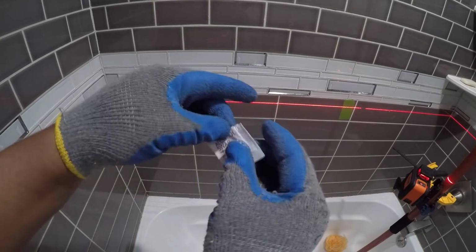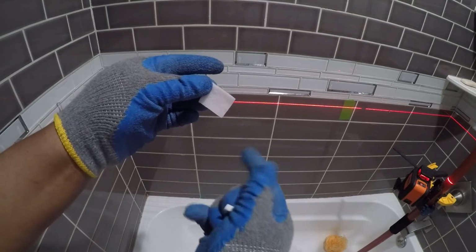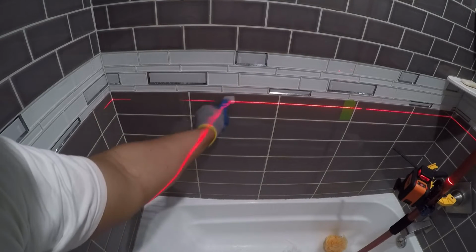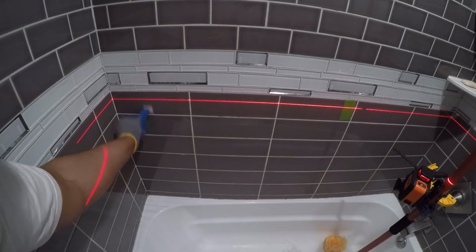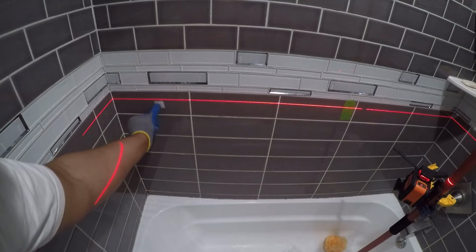Kofi is installing hooks. The glass tile is hard to drill into, even with the proper bit and an 8-pound hammer drill. Kofi had installed the shower door and it was challenging to drill holes where they should be due to the hard, slippery tile. With screw fasteners ruled out, adhesion with glue is the next viable solution, short of using sealing hangers.